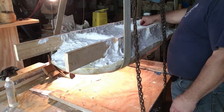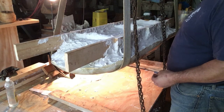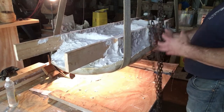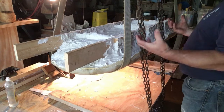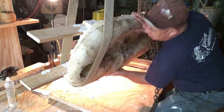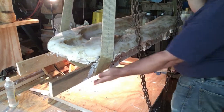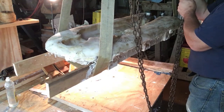You'll have to find that happy medium. It's like I can do a two-gallon bucket of plaster no problem, but if I do more than two gallons at a time, it's beyond what I can successfully accomplish. It's good to see that as this is lifting up, the rubber's falling off on its own, which is great. You don't want the register blocks that you put on to lock it in to create too much draft. You can always cut them one way or even two ways to help them collapse, but they'll still register where the rubber mold needs to be. It's nice to have this to flip it over, and everything looks good. We'll clean this up, probably release it, and do a support armature inside — similar to what this is — hopefully just embedded. As soon as we get that done, I'll mix up some plaster and we'll cast St. Francis.